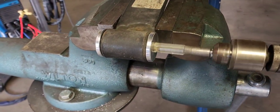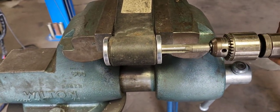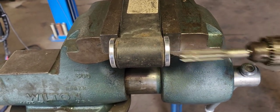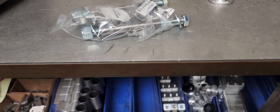After you get done pressing the bushings in, you'll sometimes notice that the holes don't line up exactly perfect — there's a little deformation going on in the aluminum and things of that sort. So we use our five-eighths carbide tip reamer just to clean the holes out, but you could also just use a regular five-eighths drill bit.